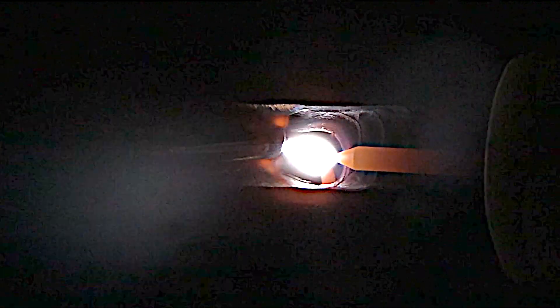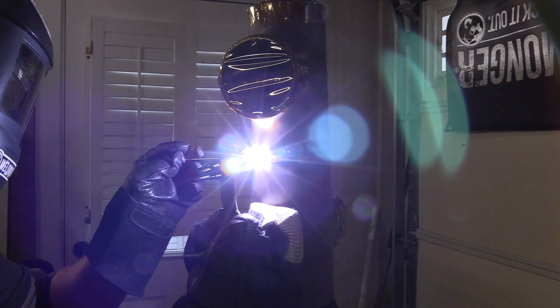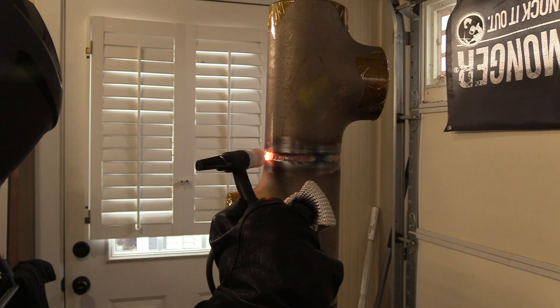It's been a good many years since I've done a joint like this so I'm not really comfortable and don't have my speed up, so 100 amps is doing it just fine - pretty safe that I'm not going to melt through or suck back. I'm not bouncing from side to side but I'm also not crawling - I'm just pausing for a moment at the toes of the weld, making sure everything wets in. I'm keeping my torch angle kicked back just a little bit and pointing upward. As long as you keep your arc length fairly tight and consistent, the torch angle can be really forgiving.